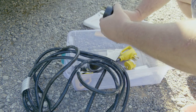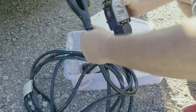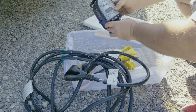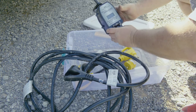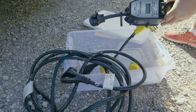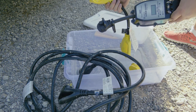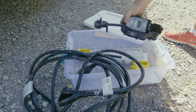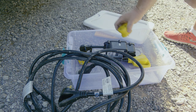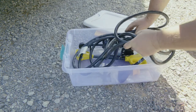Plug this into the power box, and this right here plugs into there. It will be red when it's getting ready, then click on green to tell you it's ready to go. This is for 30 amp. If you have a 50-amp hookup and no 30-amp option, you can use this adapter — it goes into the 50 and this becomes your 30. It's kind of a converter. If you're having to use a 120 outlet, you can plug this in here and plug your power into there.